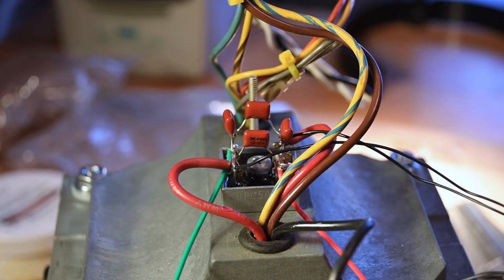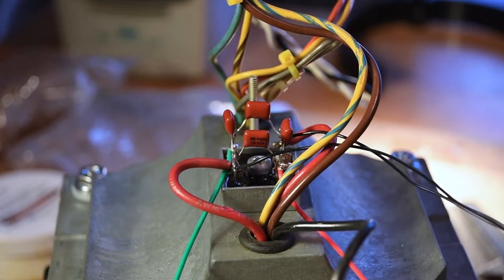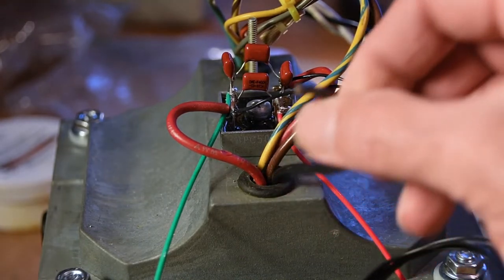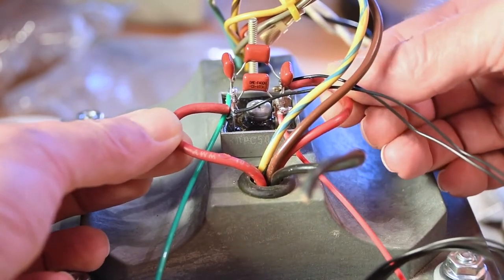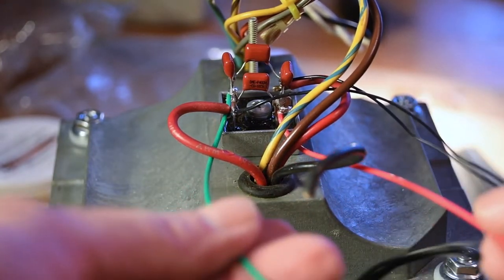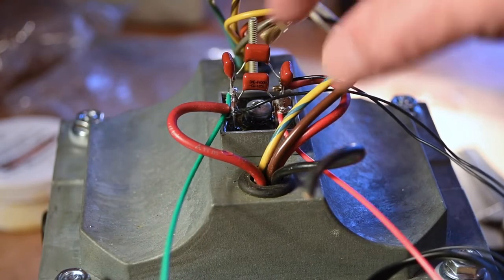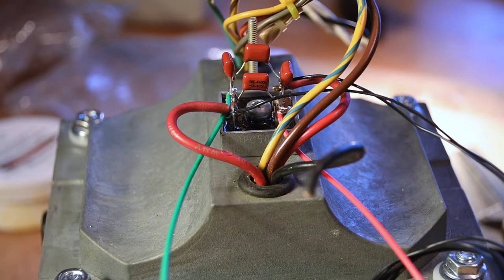This skinny little black wire is going to go to the DC protection circuit. This one goes to the neutral bus. These are your AC out wires — they're a very heavy gauge wire and took a lot of effort to solder. You have B-positive here and B-negative here. So you have negative out, positive out, AC in, and AC feed to something else. Your transformer is now ready — at least this part of it.